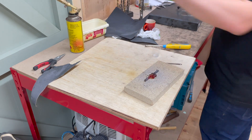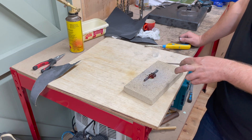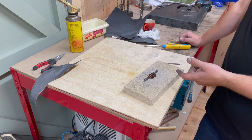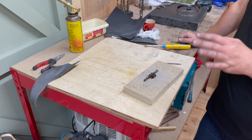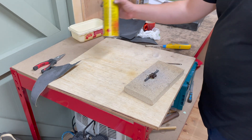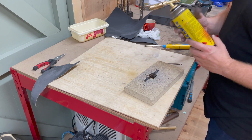I'm hoping that this solder re-melts in some meaningful way but it doesn't at all — that didn't do anything. But I'm pretty sure now I've got two solid joints on the crank webs. This one was already quite substantial, and that one now has a bead of solder around it. So I'm going to let this cool, clean it up, and call it good. I definitely have a lot to learn about silver soldering. It feels like this just isn't giving out enough heat. Need to learn a lot more.